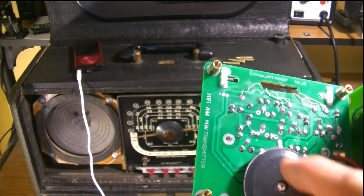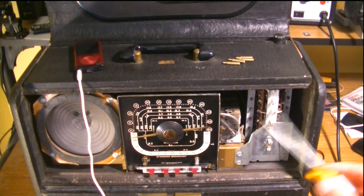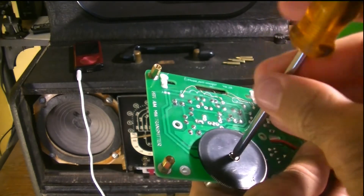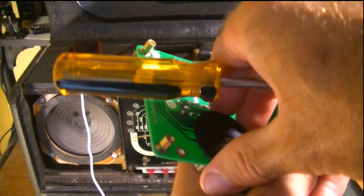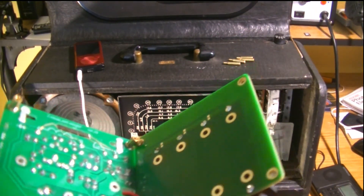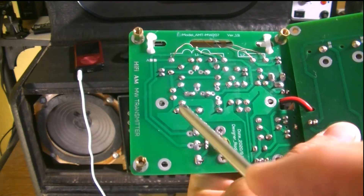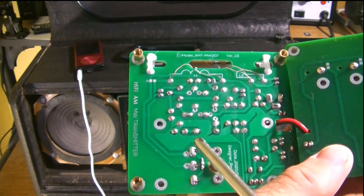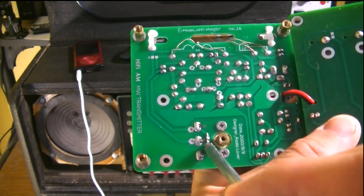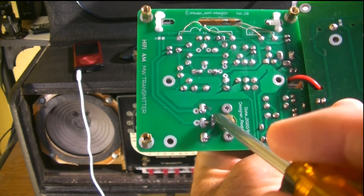There's this little output that says 'monitor' — that's just a place to connect it to an oscilloscope; it's not an antenna output. The antenna is the ferrite rod, so there is no antenna wire that you use. Also, it's possibly possible to attach an antenna to that — I don't know. There's also two little solder connector pads on the bottom: there's an A, and under this wheel there's a B.